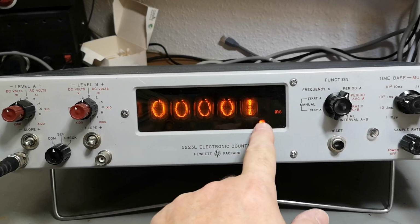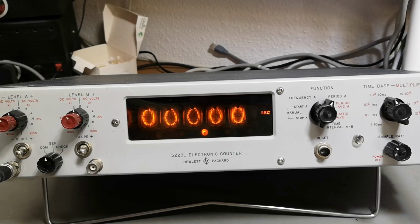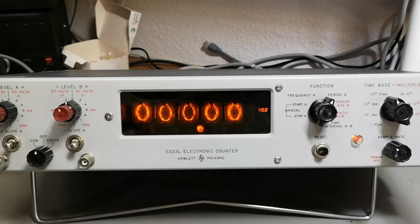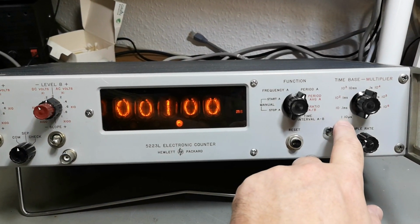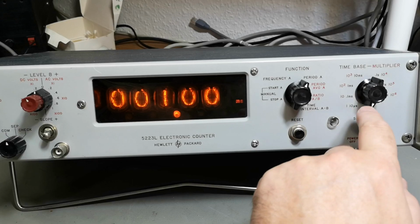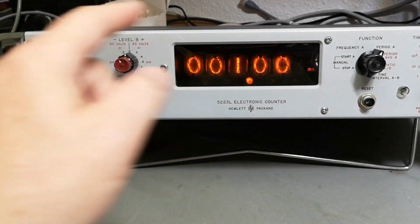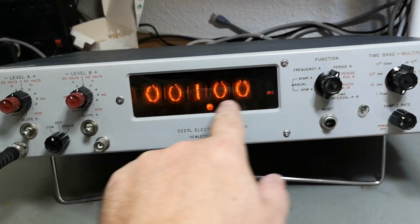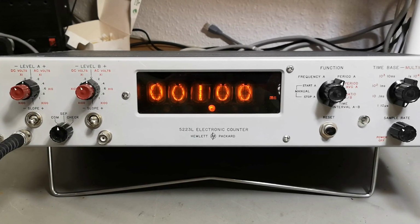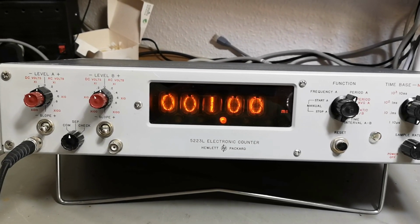Aha, so this needs to be faster or what? It needs more time or what? What am I doing wrong here? Yeah, it was me. That was dumb. Of course, this is the time base. So, of course, I need a 10 microsecond pulse, and then I am using my 1 kilohertz of input signal as the gate. So now this is the gate, and then it will count to 100, and that will be 1.00 millisecond. So let's say, hey, maybe I can actually input my frequency in time. Yeah, let me see if that is possible.